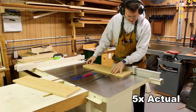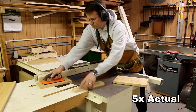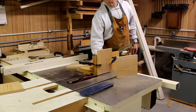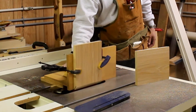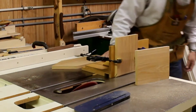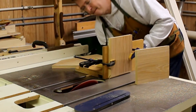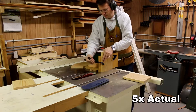Next up, I'm cutting the boards for the sides and trimming them down to width. Then I take some other boards and put them into a jig I have that cuts vertically, so I can get that 54-degree cut for the roof so that it goes together nicely as a miter. This is a very handy jig that I made years ago — you need it because you can't cut more than 45 degrees with the board flat down, but with it standing up you can get all those other angles between 45 and 90.